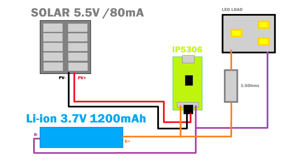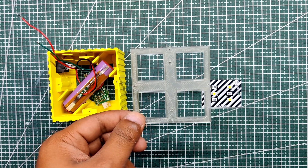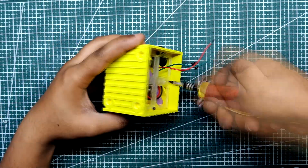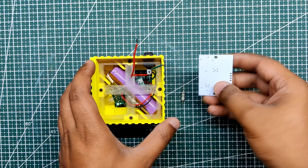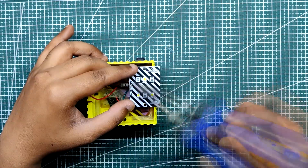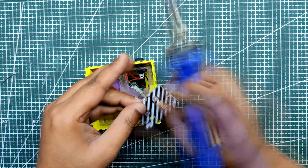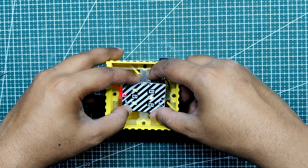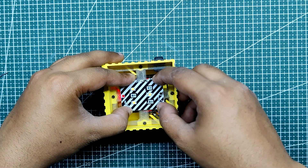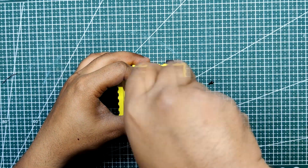As for connecting the LED load directly to the battery, the battery already has a PCM module which will cut off the battery output voltage once the battery voltage reaches 2.8 volts. After wiring, we add the LED holder in its place using four M2 screws. Using the same M2 screws, we then attach the LED PCB to the LED holder, link the positive from the switch to the positive of the LED load, and connect the resistor to the ground of the LED load. A 1.5-ohm 2-watt resistor is used here.